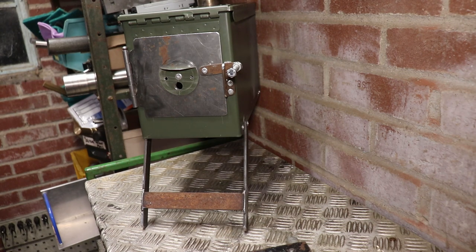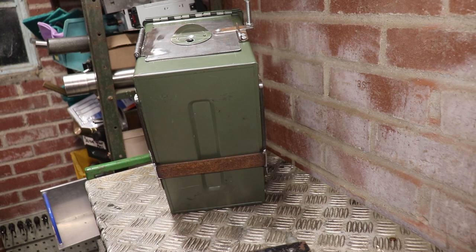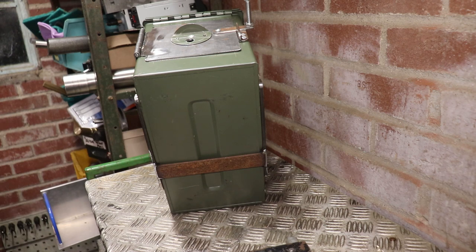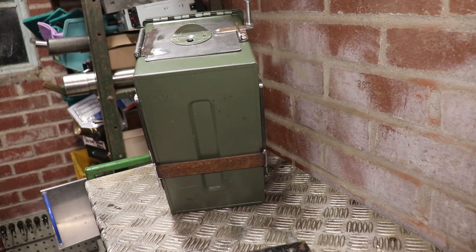We've got the front leg - I haven't got round to the back one yet - but there's a brace along the bottom, riveted in either side. It just pivots forward and stops on the rivet that's in front of it, which is holding the two inner rails in, so there's one either side. It will just fold in. I'm quite happy with that. The next one will sit outside of this one and I'll have to have a small spacer of the same thickness on the underside, and that will obviously have a brace under the bottom as well.